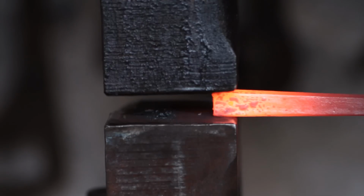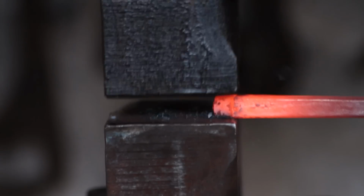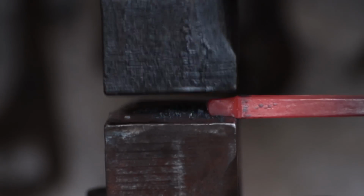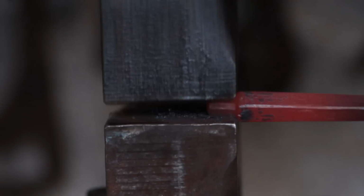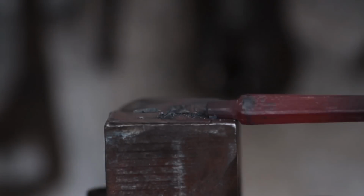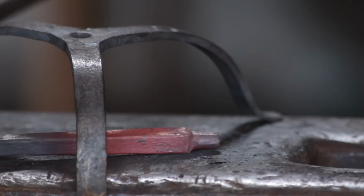Check for imperfections. And I've marked off the end at, I can't remember what it was, I think it was 3/16 or something like that. From the end, and I'll just literally bring it down to square, octagon, and the other one that everybody keeps sending me messages to tell me what it's called, the 16 face again. I'm not really making a massive effort to round it because if it's a bit rough it'll grip better in the punched hole. It's roughly 8mm round.